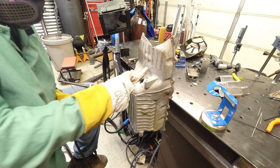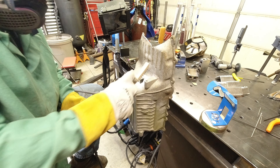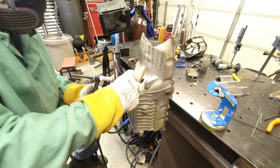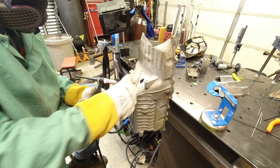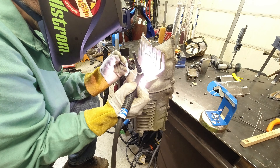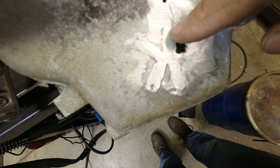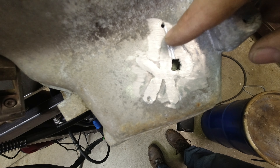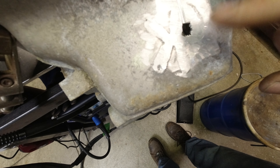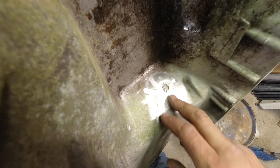We're just slowly going around, buttering it in, but there's a lot of crap in this so I'm going to slowly go around and fill it up. I'll let off periodically just to let it cool, but it really is full of garbage. While cleaning this up I found another crack that ran — probably because the heat expanded it — so I drilled another hole and we've got to fill that too. Cleaned out the back side, took a little filler in there as well. There's a lot of sink on this side, so I've got to try to fill this in, then get it all sanded off.